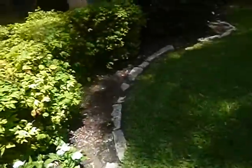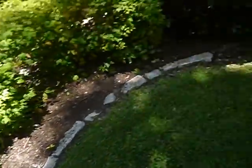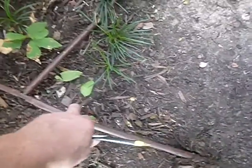Alright. Then here in the flower bed, here's another clean out. I'd like to see doubles, but we do have a clean out, and we may have doubles, like just all the wood mulch. We don't know. We do know we have one. While we're at it, these lawn sprinklers, this drip irrigation, they're allowed to be exposed like that. But they're also supposed to be stapled every 12 inches to the ground. It's kind of silly, but that's what's supposed to happen.